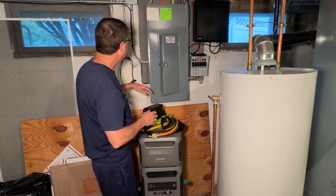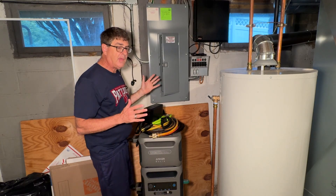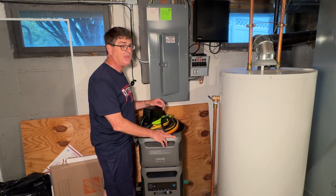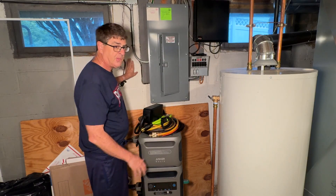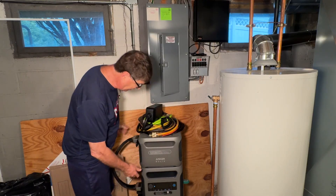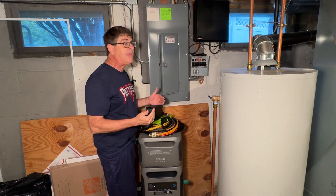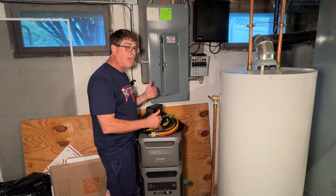That way I can pick which circuits I want to energize and I don't have to open any windows outside. The generator will still have to be wheeled outside, but I figure I'll only have to run it maybe two, maybe three hours to charge this, shut it down, and then this will run probably for anywhere from eight to ten hours powering the stuff in the house. So we're going to bring in the 240-volt inlet to somewhere here, which will plug into the pass-through charging, then that'll go in, and coming out there'll be an inlet here, this will go away, and there'll be an interlock here. That's how I'm retrofitting away from gasoline and making the Anker Solix F3800 Plus my primary backup power.